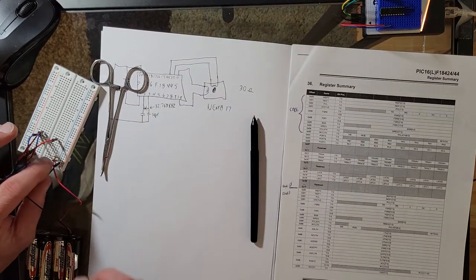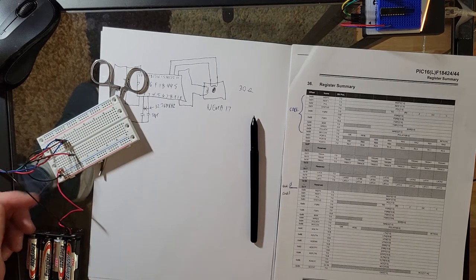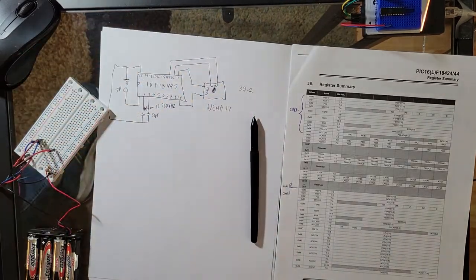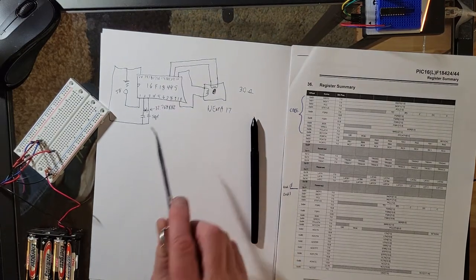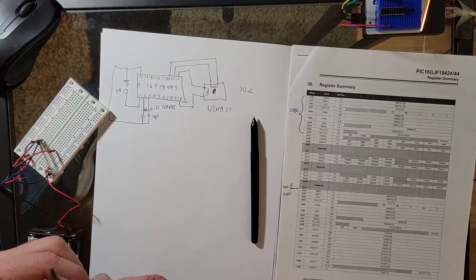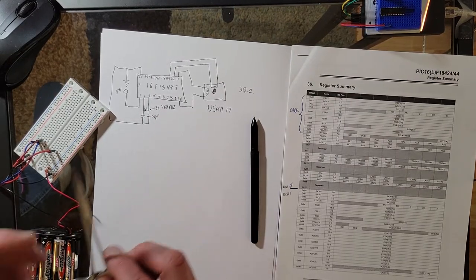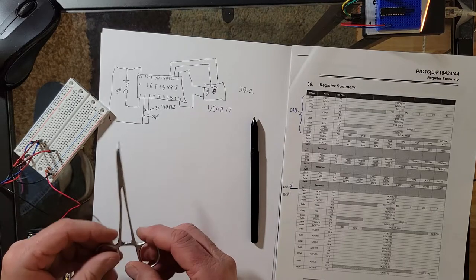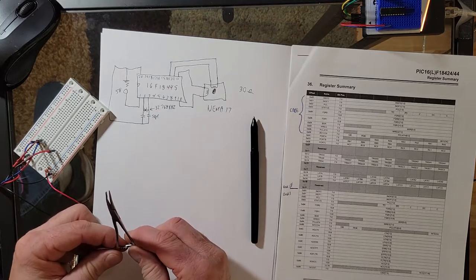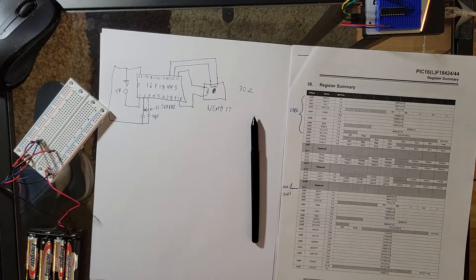So that's basically those little capacitors. When you're doing crystal oscillators, usually it takes two capacitors, as you can see in this picture. Is that drawn correctly? Yes, it is. You have two capacitors here, and I'm using what they call NPO capacitors. It's to do with more stability with temperature. Even with a crystal oscillator that's tuned to exactly a certain frequency, it will wander a little bit based on temperature. So even the capacitors cause it to wander a little bit, so you might choose your capacitors as NPO. They're about the same price as all the other capacitors I've noticed. You buy 10 of them for a buck, roughly. And that little watch crystal there might be maybe a dollar. I'm not even sure what the cost is anymore.